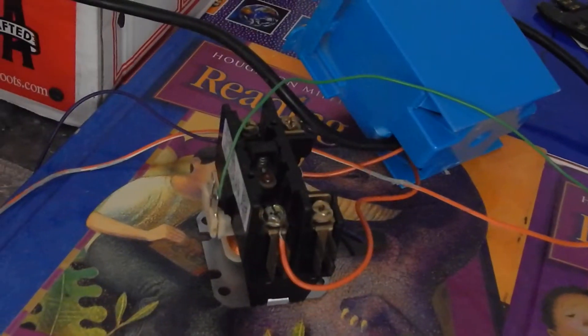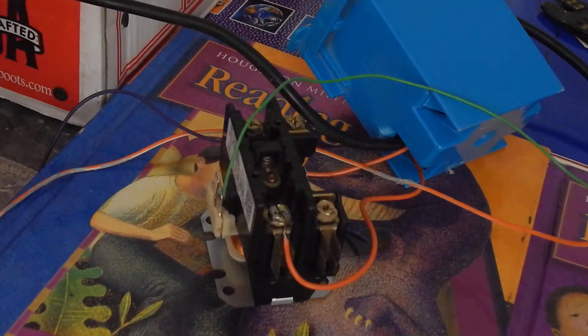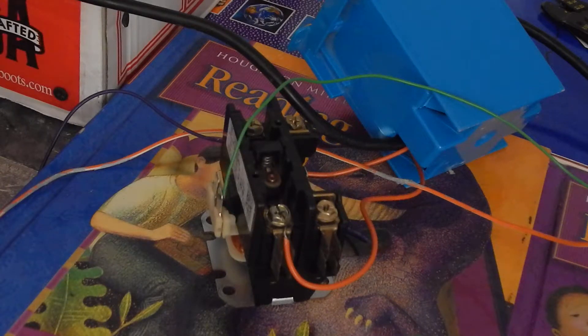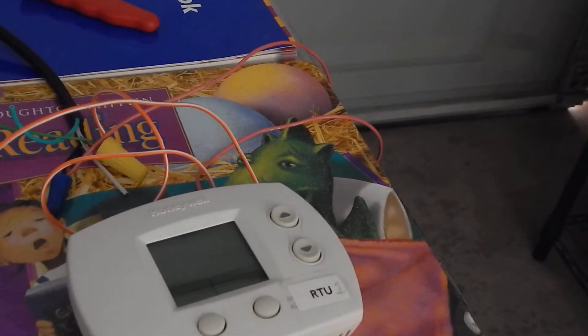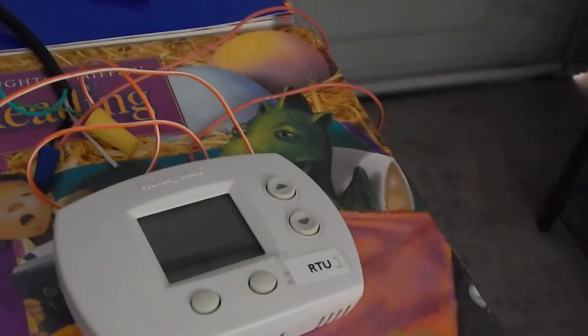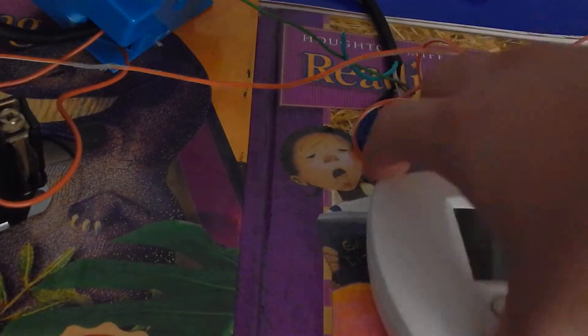Just make sure you have a 20-amp, 120-volt circuit or you'll trip your breaker. If you want to hook a household fan up to a thermostat, this is the easy way — your thermostat will automatically click it on and off. Just remember you need a separate power supply for the contactor coil and the thermostat together if your thermostat is not self-powered.